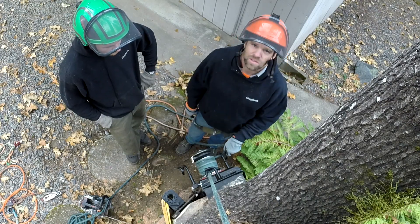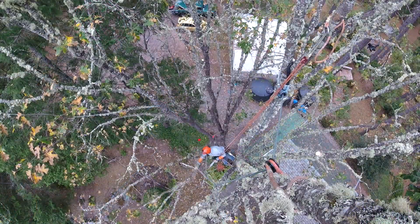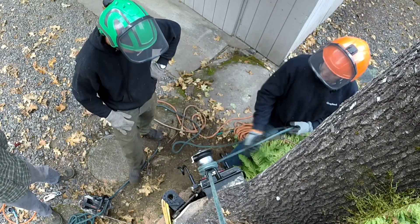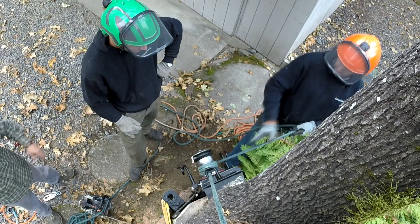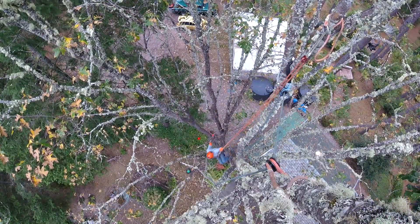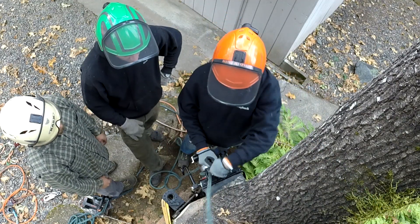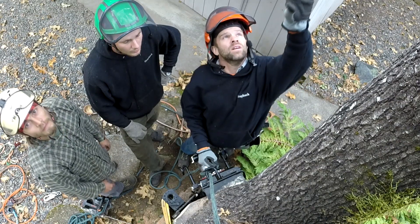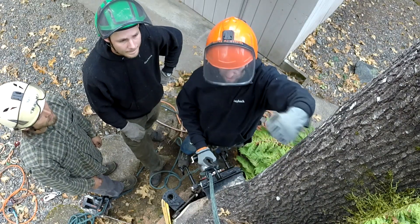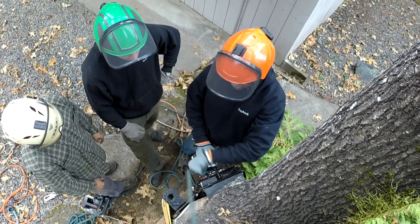You'll see in the video kind of how it works. Not super high tech or complicated stuff we're doing today, just for demonstration purposes. Now are you always going to want to rig it through one of these? Unless you're off to the side — if you're off this way to the drum, then no problem, but you can't go stepping out like this or it'll come back off. So that's what these are for. You may have to put an X ring or something here to make sure the rope is feeding straight in. When I'm up there, I'm going to make sure the rope is coming straight down and into here. If it was coming at an angle, I would have a ring or block to redirect it straight in, because you don't want to put crazy power on these fair leads — they'll just bend right off.